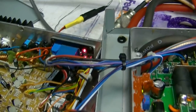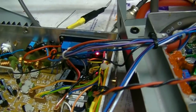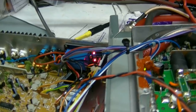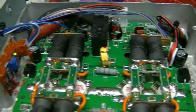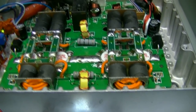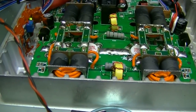This is only the second mobile that I've done with this thermostatically controlled relay for the fan, and it works out really nice. I mostly do this on base stations when I add amps. The fan is lit up when it's running — when it's not running the LEDs will be out. There's your 2879 red dots — they are screaming. You can actually run this thing up to about 15 to 15.8 volts, somewhere around that area, you'll be fine.